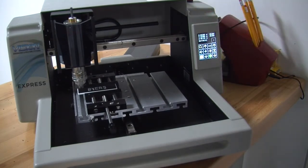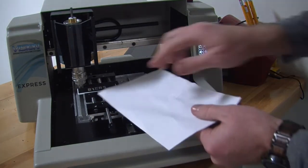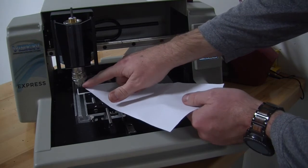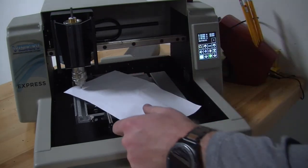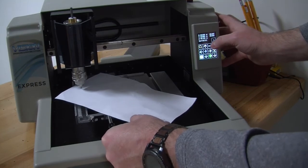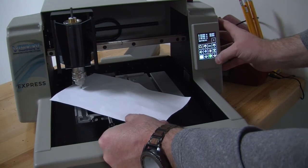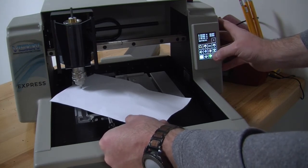Once you are close, you need to get your piece of paper. Your piece of paper will go between the badge and the spindle. Now we are going to be making such small movements that we won't be able to see it with our eyes, so the paper acts as a stop.